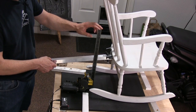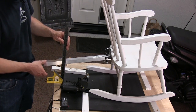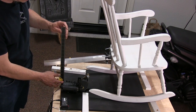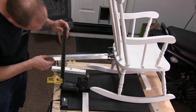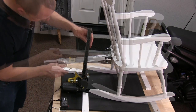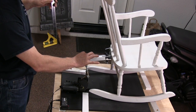That's about two and a half inches, so that's too little. It's important to note the further you go back with the lever, the less force is needed to animate your prop — so if torque is an issue depending on what kind of gear motor you're using, that's something to consider. Going back here to look at the throw again using my blocks as a guide, I can already tell that's going to be way too much. So that's about six and a half to nine and a half inches — about three inches of throw. That's my sweet spot, and I know that's where I want to link this linkage bar up to.